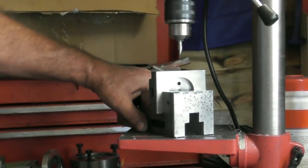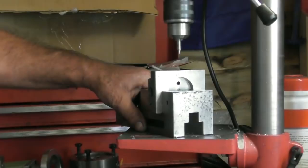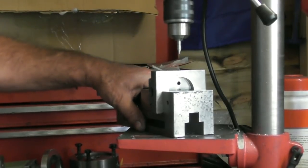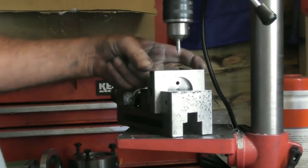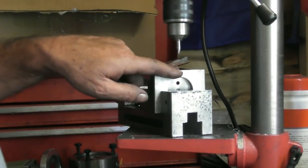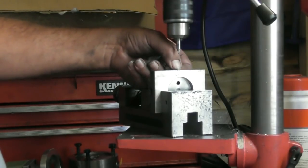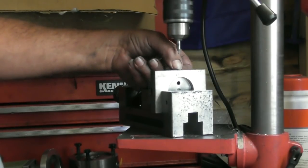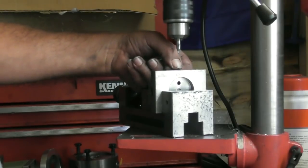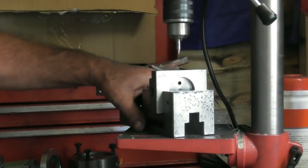So we pulled it back out of the lathe. I've cleaned all the cast iron off the lathe, well, certainly off the bedways and everything that's important. It's still in the tray there, and I will clear that up. I've marked out a centre line, described a very fine line, marked out a line 4mm up from the base, so that I can put an M6 grub screw in there, and I'll still have 1mm of wall. Well, I have 4mm up, I will have a millimetre of wall, so I'm happy with that.